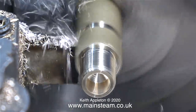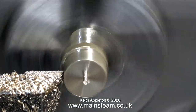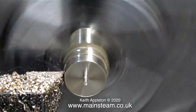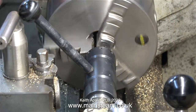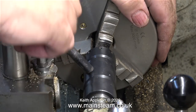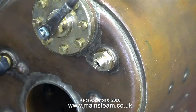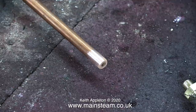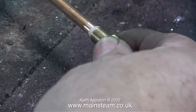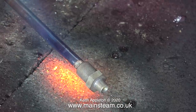I need to make a pair of fittings which are quite similar but not identical for both ends of the hollow stay. In this clip I've just parted off the bit that I need, turned it round in the chuck — holding the component by the threads, which is not good practice. I need to turn down the other end to a quarter of an inch diameter and thread it quarter-inch by 40 threads per inch to take a standard steam union. Now it's into the outer part of the workshop to apply Easy Flow Number 2 flux and then silver solder the part onto the hollow stay using Silver Flow 55. And thanks to the magic of video editing, here's the finished job.